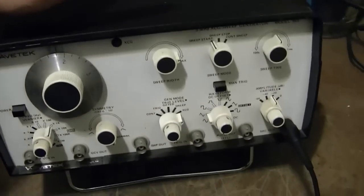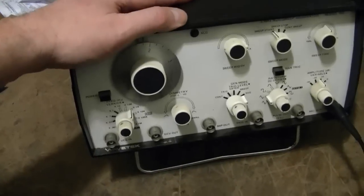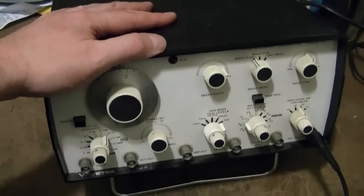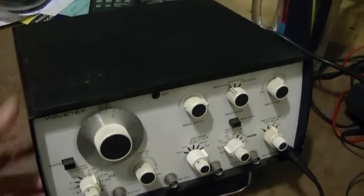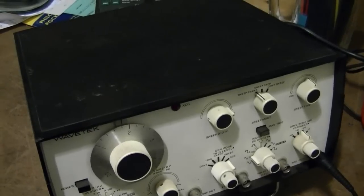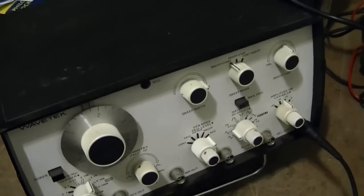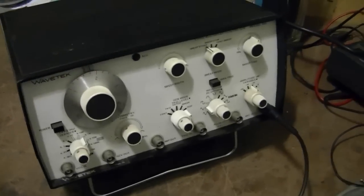Something else I really like about this is the way it's made. It's from the late 70s into the early 80s, and they used all off-the-shelf parts on a couple giant circuit boards. So very easy to repair, except maybe for that output amplifier. Unlike Hewlett-Packard, where first off, everything's house numbered, but even if you can figure out what those house number parts translate to, often there's some more exotic stuff, or sealed modules, and the replacements can get kind of expensive. This, piece of cake to service.